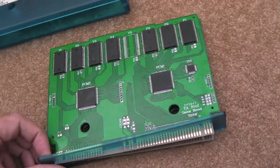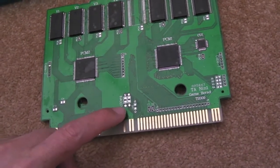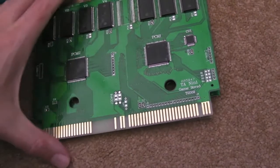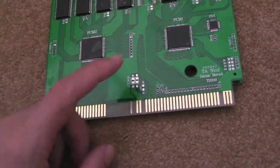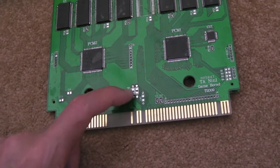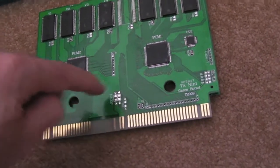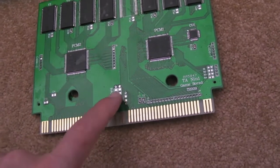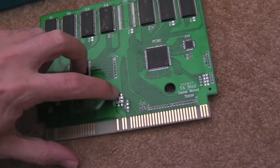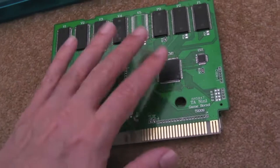As I mentioned earlier, I did the mod to this — removed the diodes. There were originally two 1N4007s. The way it works is simple: you get your 5 volts in, it comes into the first diode, which induces a voltage drop of approximately 0.7 volts. The output goes through the board and comes back up through the anode to cathode of the next diode — so you get another 0.7 volt drop. Then that top right pin is used to supply the 3.3 volts used by these chips, the CPLDs/FPGAs, and the CPU. It's all 3.3 volt logic on there.